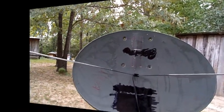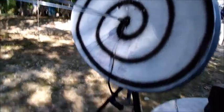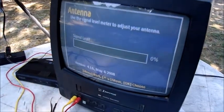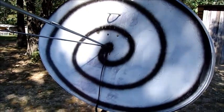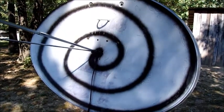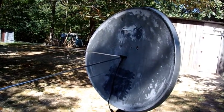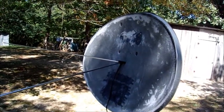The TV station I was trying to draw in is a low signal just for that one town, so just getting it on rabbit ears like this is pretty good. On this test I painted the dish to see if it affects the signal — it really knocked the TV signal down really low. My opinion: do not paint your dish, it just makes it harder to draw in antenna signals. I used turpentine to strip all the spray paint back off, and that brought the signal meter jumping between 25 and 30. Do not paint your dish — it was a big mistake and it takes a long time to get it off.